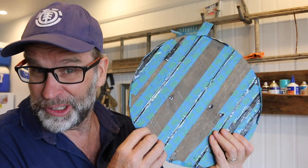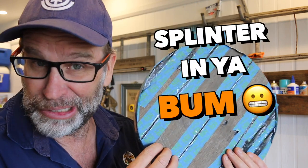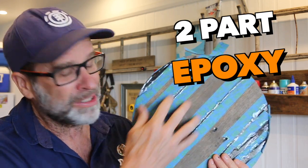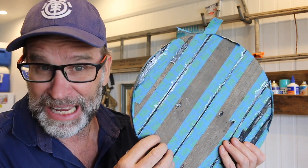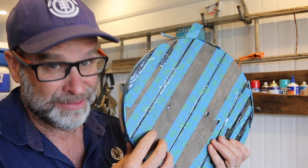With the seat, because it's old hardwood, I found it a bit splintery and let's face it, you don't want a splinter in your bum. So all I did was pull out the old tin of epoxy, dig out all those nooks and crannies, fill those in with the epoxy, and we'll come back later and sand that back. Alrighty, let's make those legs.